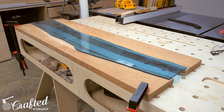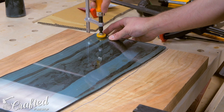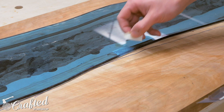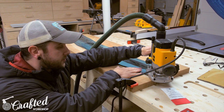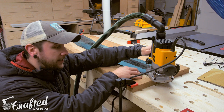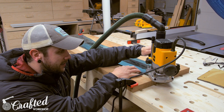Once I had the glass, it was time to route the slab to fit it. I secured the two slab pieces to my assembly table using clamps and then clamped the glass to the wood, adding double-stick tape under the edge of the glass to keep it flush. I'm using a quarter-inch by half-inch template bit that rides along the edge of the glass and cuts out a half-inch wide channel that is roughly a quarter-inch deep. I'll make one pass, lower the bit slightly, then come back for the full depth to get the glass flush inset with the top. It's a fairly simple operation, but inherently a little dangerous since you're riding a router bit up against a piece of glass — so do this at your own risk.